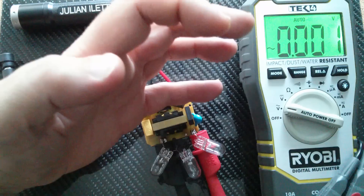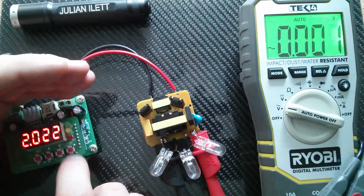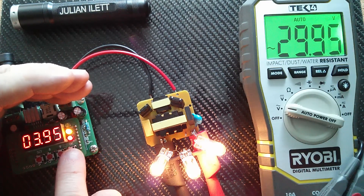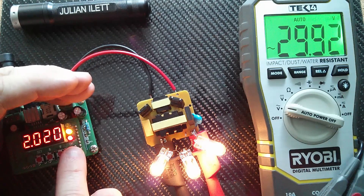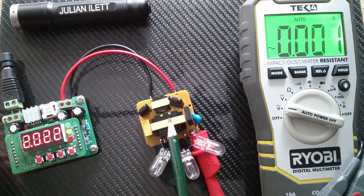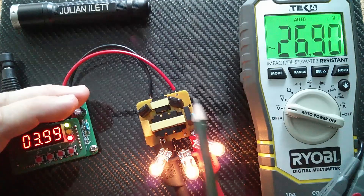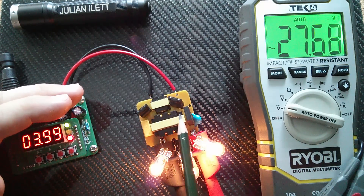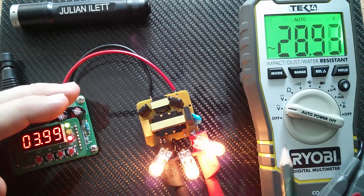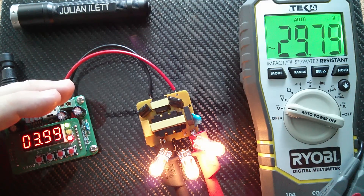Yes, they're very, very hot — probably within their operational temperature range but I can't keep my finger on there for very long. So what did we get to? We got to 4 volts, which is really quite perfect because that's about where my lithium cell is going to be when it's starting to get full, and about 2 amps. This unit on the eBay listing was rated for 35 watt operation. If I've got 2 amps going in and about 4 volts, that's only 8 watts on the input, so it's well below what it is notionally rated at. I don't think it would run at 35 watts, quite honestly. These lamps on the output — we've gotten sort of in the ballpark of 36 volts. These are only 1 watt lamps, so there's only 3 watts actually being burnt there, so the numbers don't really quite tie up.